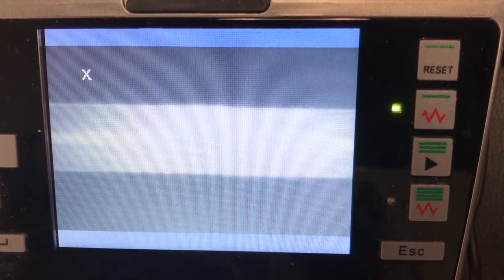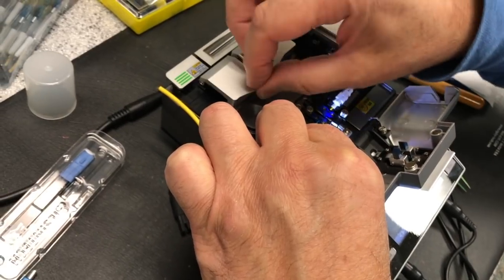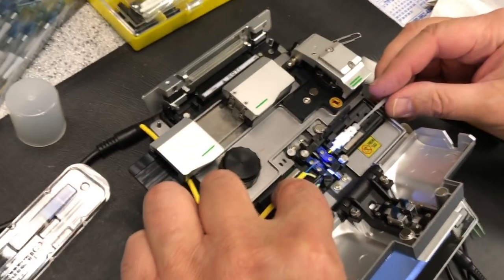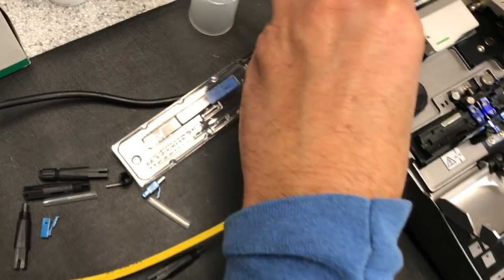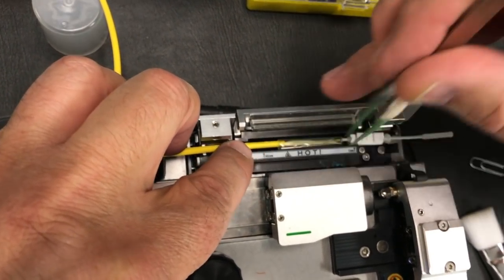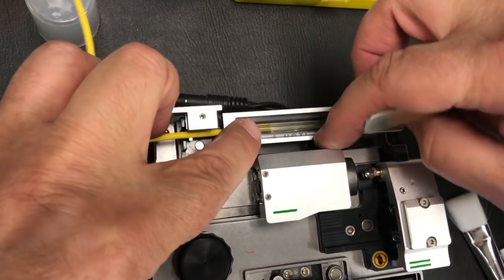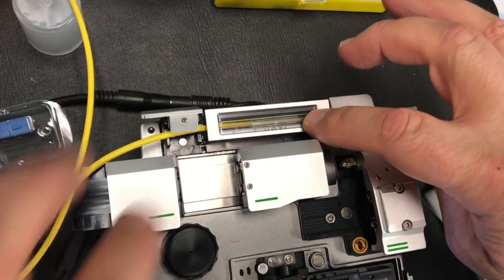You can see that — now it's one piece of fiber instead of two. We still have to shrink it and do a couple more things. We're now in the position of having a very fragile piece of fiber with two really heavy things on either end of it, so we have to pick it up very carefully. This is basically just heat shrink, and there's a little piece of metal inside the heat shrink which gives it a little extra strength right where the splice is. We put it in the heater and that's going to shrink it up.